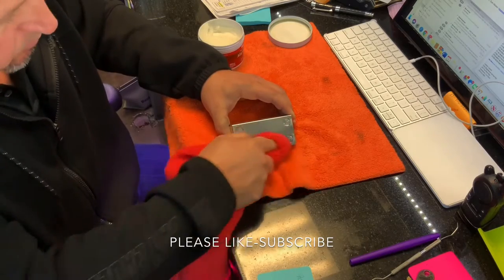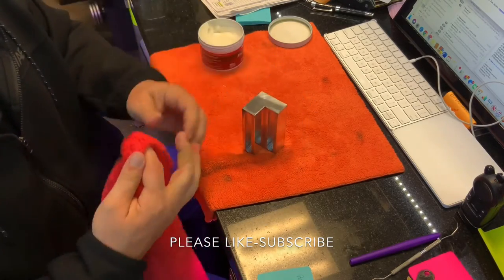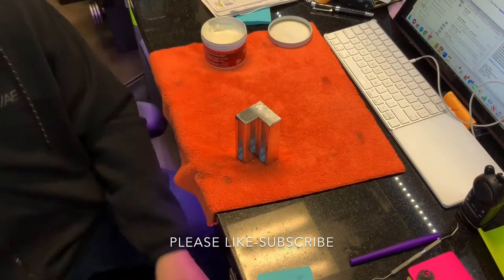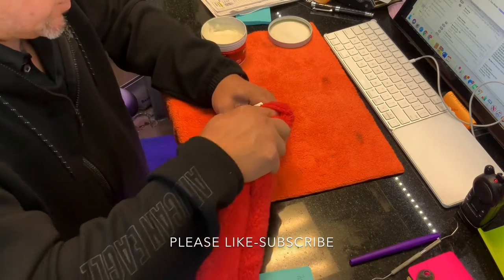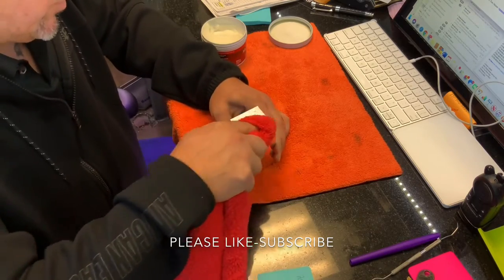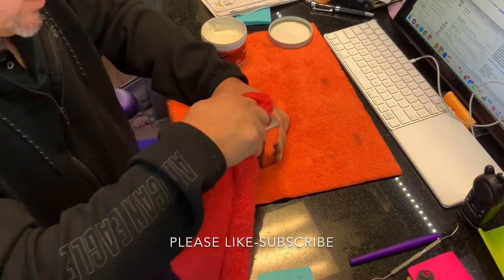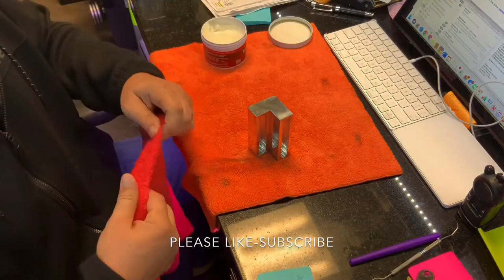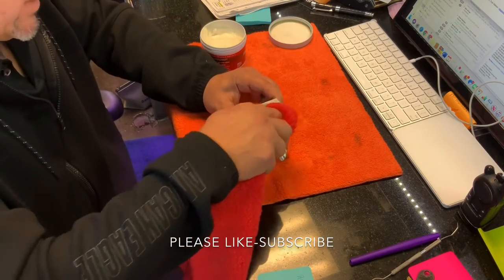Our biggest card holder so far is about over 100 pounds, and I'm sure somebody will hire us to make a 200 or 300 pound one soon. I just want to show you how nice a machine finish can look. There are many different ways this can wind up based on the tools being cut with. If you're not familiar with a CNC machine, it's basically like a giant drill press that moves bits across the metal to cut out shapes and edges. The final pass is generally what's called the face mill, which leaves these grooves in the metal. The slower you do it, the less the grooves are apparent. The faster you do it, the more the grooves will stand out.